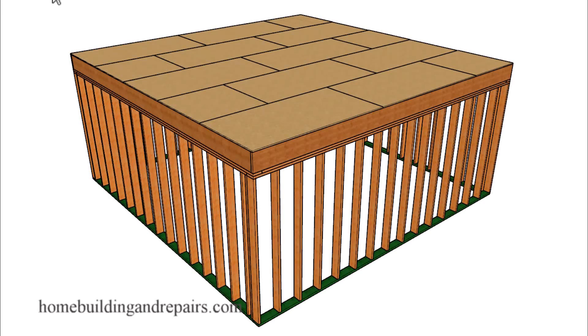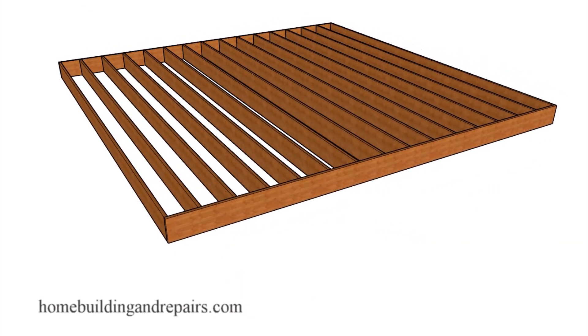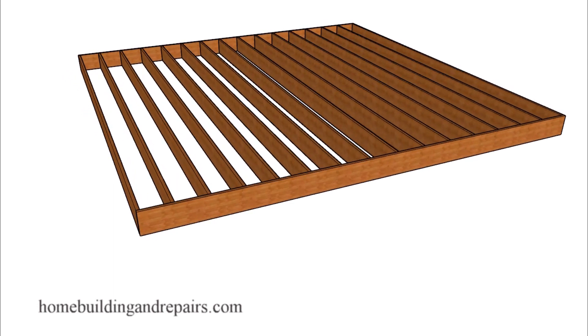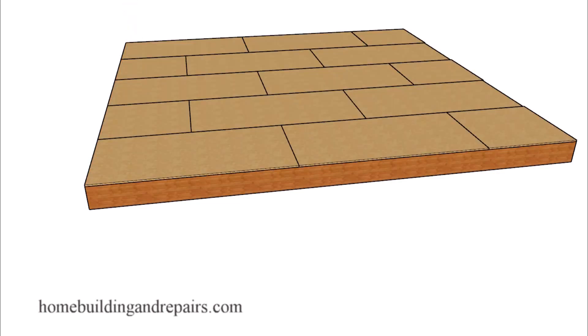In this video I will show you how you can move a bowed joist over — a joist that would need to move to the right or the left and is not straight. Before I get started, if the floor is not sagging or suffering from some type of damage, you might want to just leave this one alone. It's not going to be easy. You're going to have to remove all of the nails from the floor sheathing before you can move the center of the joist. This is not a common or popular home repair.